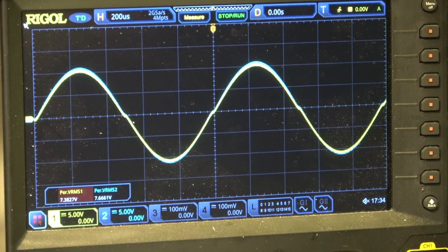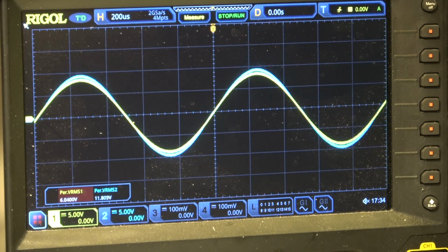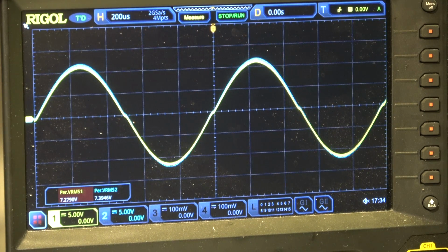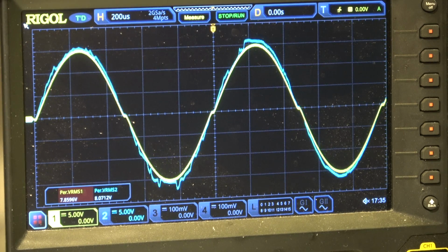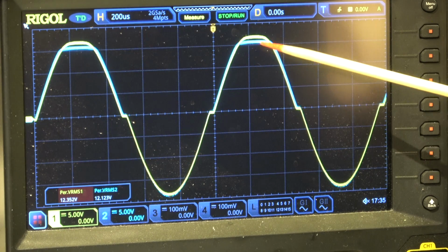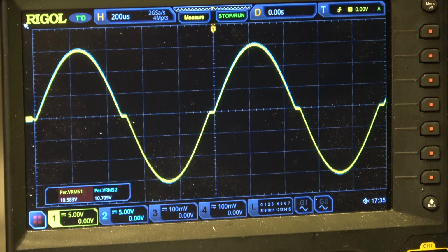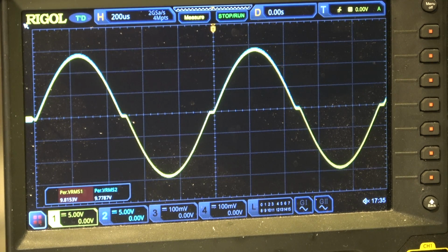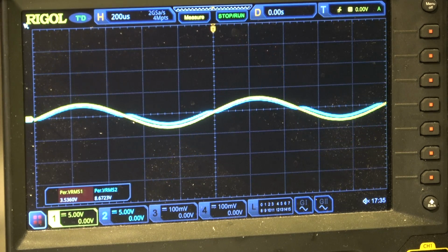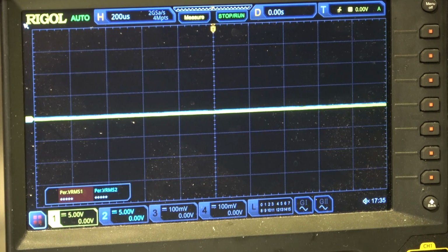It's 7 volt RMS. I don't understand why. The pot is a catastrophe, and the schematic also. We will have a look at the schematic now to see why it is jumping up with a dirty pot. And this goes over. Now we come to the clipping. Yes. It is 10 volt RMS. 25 watts, not 50. But why do we have these jumps? Okay, still cool. Let's have a look at the schematic.